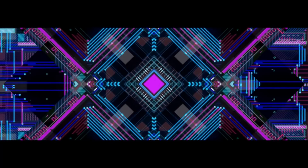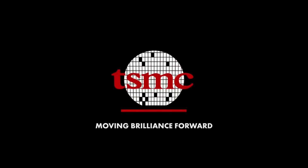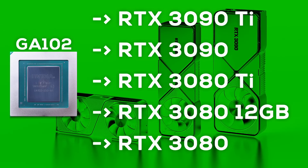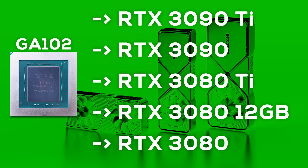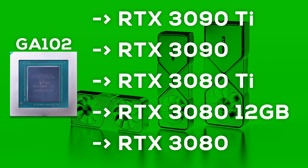Next is GPU binning, which is a process that involves finding and salvaging chips that have partial defects. Not every AD102 die produced by TSMC turns out to be perfect — for such a large chip, a defect is bound to happen more often than not. But instead of throwing away every chip with a defect, quality control works to figure out which parts of the die are affected. The defective parts are then disabled and sold as binned versions of the GPU. That way, one single chip is used in different products: a flawless ultra-high-end version with no defects, chips with slight defect rates just below that, and heavily binned parts at the bottom. If done right, basically every chip can be used, decreasing waste.